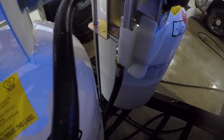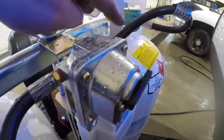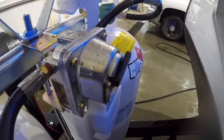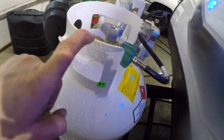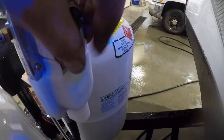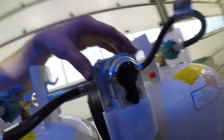Also on the front here, we have your propane system storage and your regulator. This is a crossover regulator — whatever direction this handle is pointing in, that is the tank it'll draw from first. When the pressure drops below a predetermined amount, it'll automatically switch over and draw from the other tank regardless of the position of the handle. One thing I've noticed is that some people will put the handle in the middle position thinking it shuts it off — it doesn't. It doesn't do a thing.